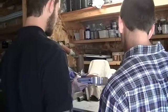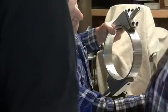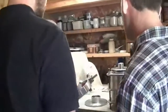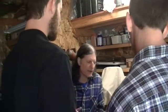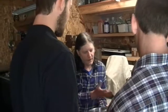On this side I made up a dual nozzle. I lined up the single nozzle at the center plate, and then the dual nozzles are for the outer two plates. Depending on how you set up your gas system, you'd probably want to put gas solenoids on these two so you could use one nozzle or two nozzles, or both simultaneously. You can make up different nozzles as you experiment.